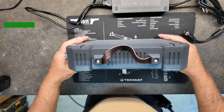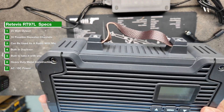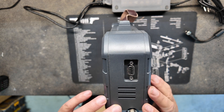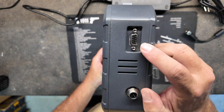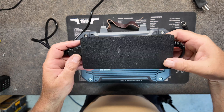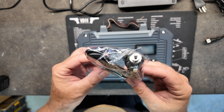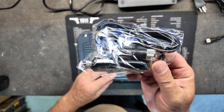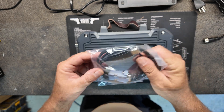This is a super heavy-duty constructed repeater with an all-metal case. It's got a funky little leather strap on the top, which actually helped cut down on some RFI they were having. It has a proprietary power plug and an RS-232 on one side, and an SO-239 antenna port on the other. The radio comes with a power adapter, a cigarette lighter adapter plug — which came in really handy on my trip — mounting hardware, and for programming, an RS-232 to USB cable.